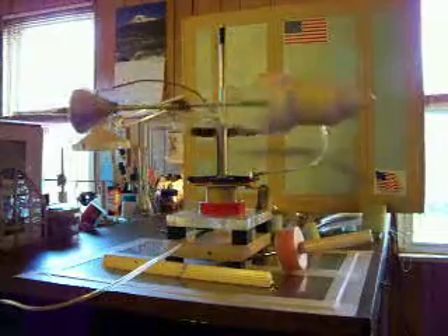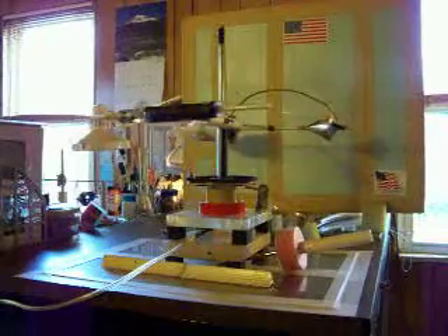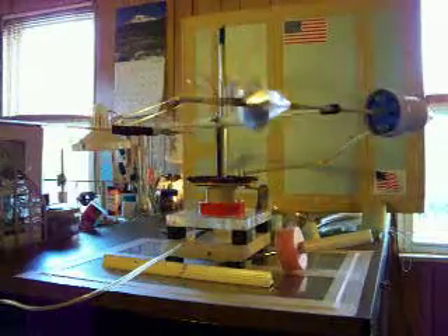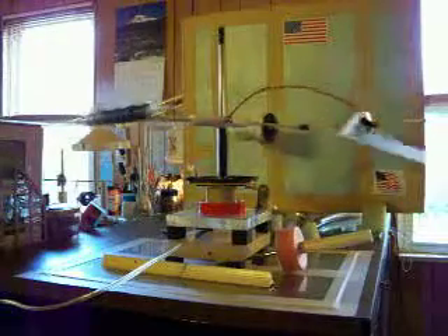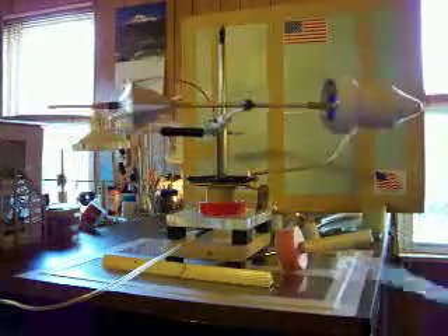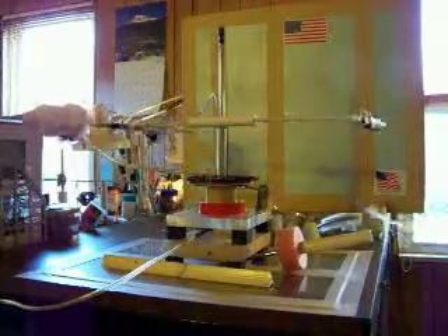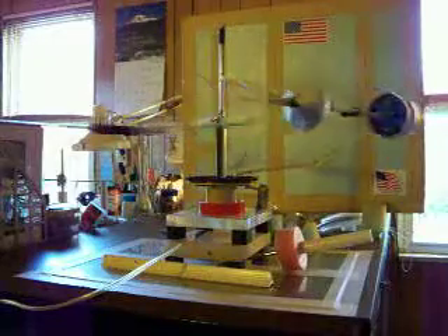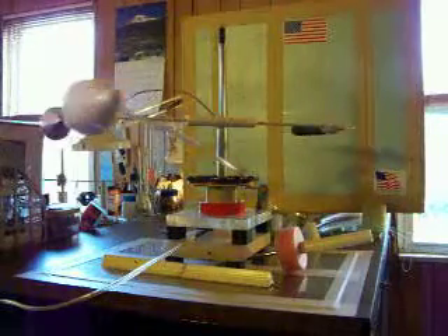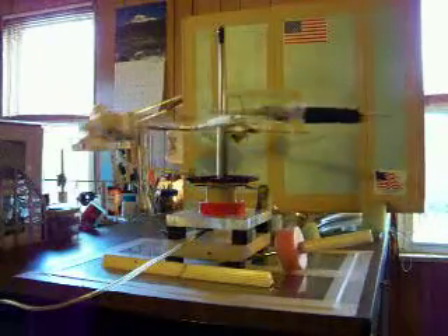I had to make a lot of changes to this new rotating system. I'm still tinkering with it, trying to tune it in if you want to call it that. I changed the axle hub length — much higher now — and I'm keeping the weight down low. I had a lot of trouble with the commutator. I was getting a lot of ionization off of the commutator which was actually stalling it. All the power was being emitted in the commutator. I finally got that under control, because you could hear a very distinct buzzing sound. It's very quiet now.